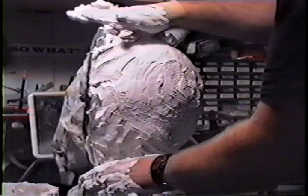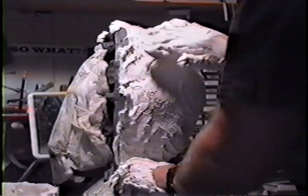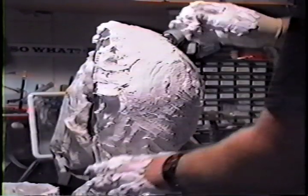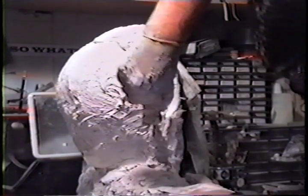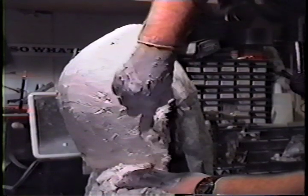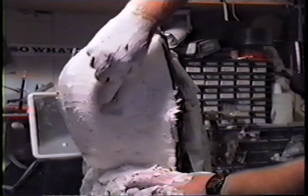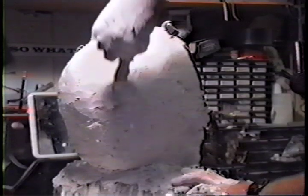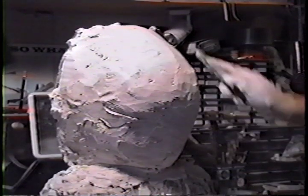Build up those layers, and if we've got loose fibers sticking out, we take what's left in the bowl and spatula it on, smoothing the surface, building up so forth and so forth. For little ugly areas, I get a little scraper while it's still fairly soft — plaster will take a while to get harder and harder — and scrape it off. The final step is scraping with plaster knives, plaster scrapers, files, rasps.